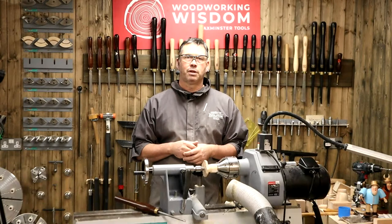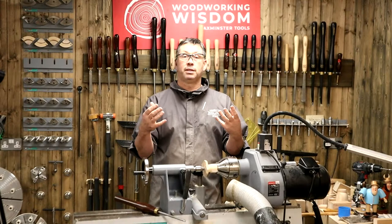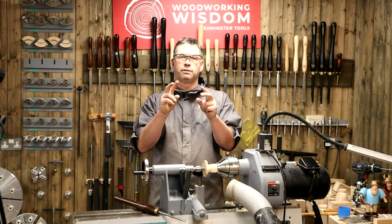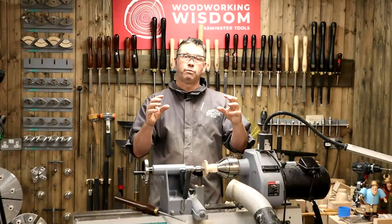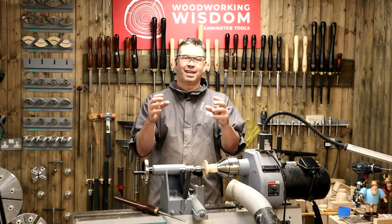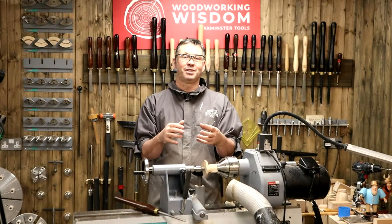All right, definitely. One thing I'll also mention: we've turned together the Christmas carousels, Christmas pyramids. And I'm getting a few people saying, oh, I can't get them to turn. So there are a few reasons for that. Friction would be the main one. That needle has to be an absolute point. The second reason will be the distance from the impellers to the candles. The third will be too much weight in the impellers and the scene. And the fourth, which is out of your control a lot of the time, will be the temperature within the house. If you've got a very hot house, you're not getting a lot of energy from the candles. If you've got a cold house, it's going to go around really quickly and easily. So there we are. Just wanted to say that.